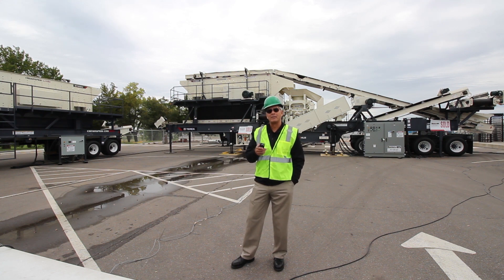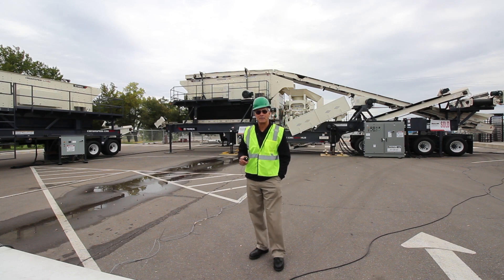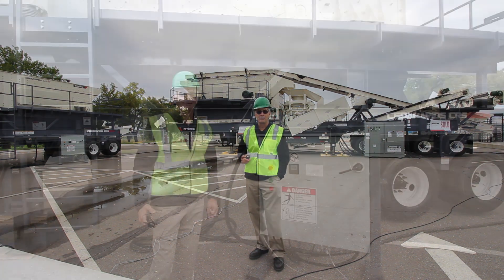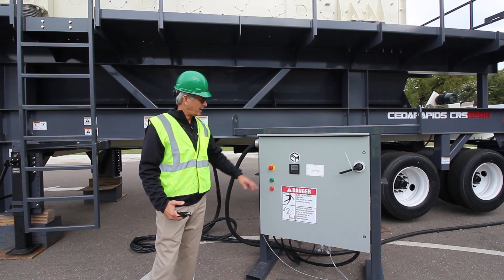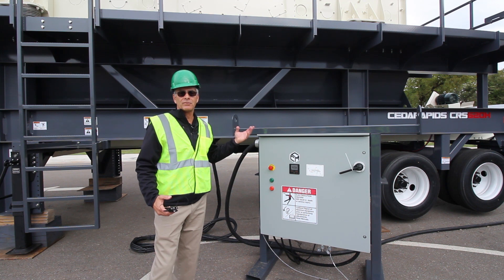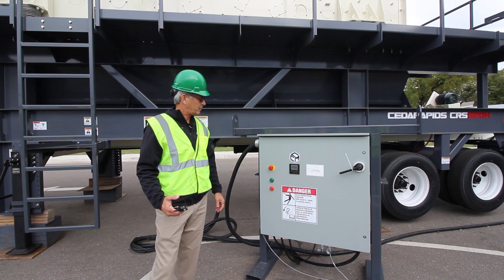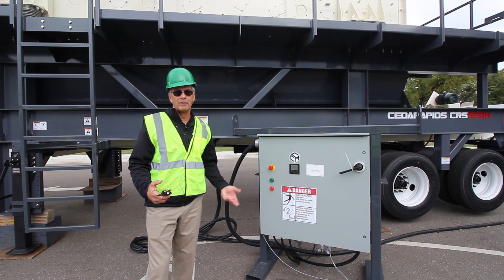This new equipment makes it safer, much easier, and much more reliable and durable than traditional systems used in the market today. The standard CCM panel is very easy to operate — it simply has an on and an off button and all the motor starters start in the proper sequence. All the interlocking is automated, making it very easy for the operator to learn and train on. A simple on button turns on the entire plant.